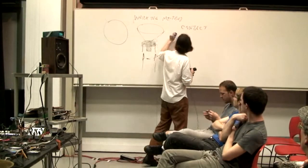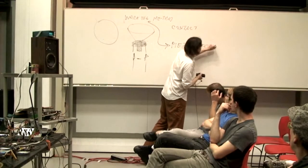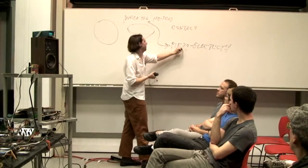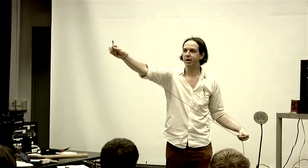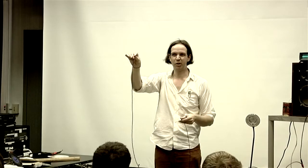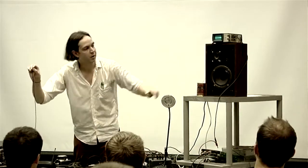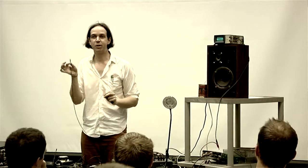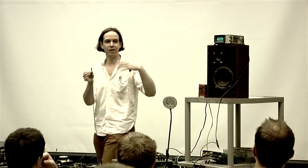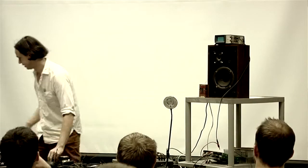Another kind of microphone, designed for listening to sounds through solid objects, we refer to as a contact microphone — it's idealized for listening to sounds through hard materials, but not through the air. This particular kind of microphone works by what we call piezoelectricity, which is a fancy word for materials that generate electricity when they are bent. The microphone itself is this little blue dot right here — a tiny little piece of brass with a chip of a particular kind of crystal material on it, which has the unique physical property that when it bends, it generates a small voltage.